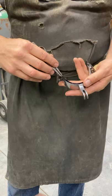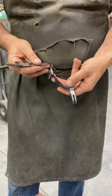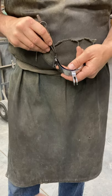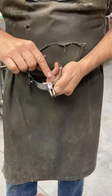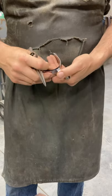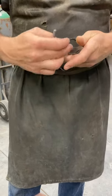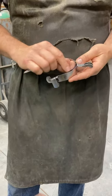Since this part of the band is thicker and this is thinner, marking from the outside means I'll be a ways from the inside here and then real close to the end over here. So you can see my line is going to be real close there and then real far away here. Now if I want that line to be straight and even so that you hide the taper, simply mark from the inside. What that means is right here you basically don't have any round, and then you've got a lot of round here.